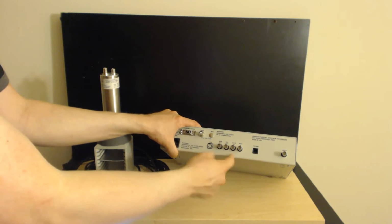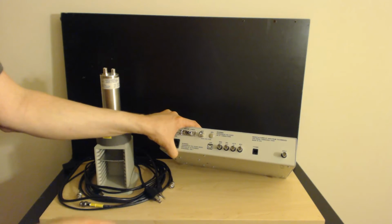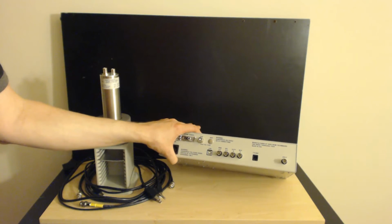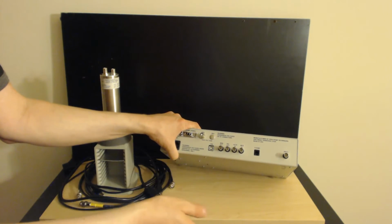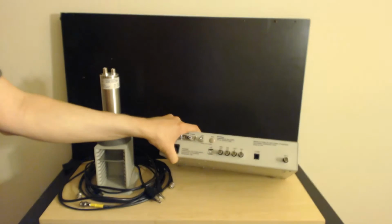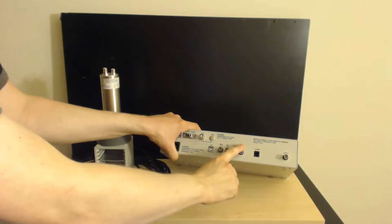You have a gate in. This is for coincidence checking, which would be useful also if you're into looking at more cosmic events or anything like that. And actually, there's a lot of basic nuclear physics experiments that require coincidence or anti-coincidence. And you can have multi-channel scaling devices hooked into it as well, although this device is capable of doing multi-channel scaling without using this whatsoever.